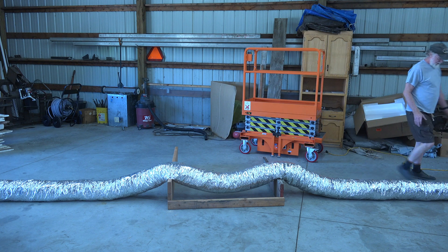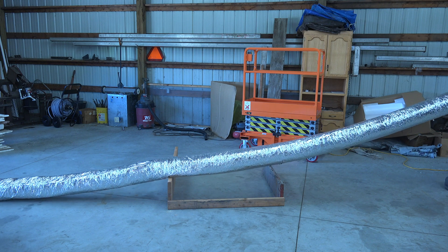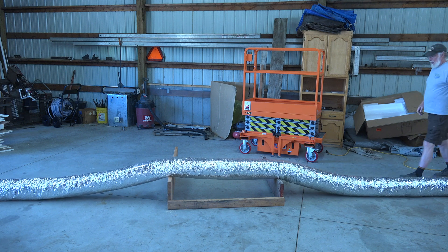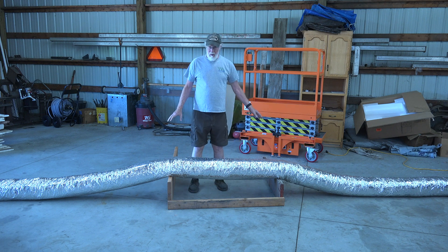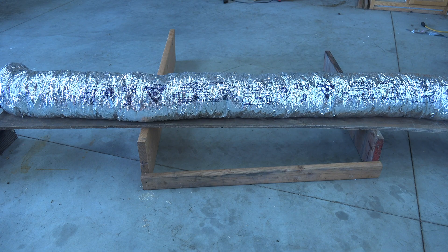Stretching it when you're installing it holds up a little better at least to start with, but it's probably still going to sag after a while. If there's any way I can do it, I want to put something underneath it. I don't want to hang that from the rafters — I think that's a terrible way to put in flex duct. It's going to sag more and more as time goes on.